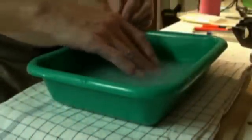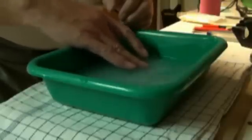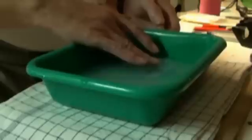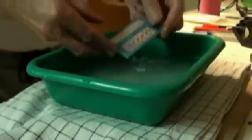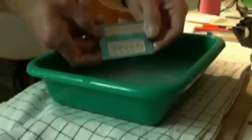The development takes place in a 10 gram per liter soda solution where you move the silver around and carefully make sure that it is stirred thoroughly. The bath should preferably be 25 to 28 degrees centigrade. When ready, it is washed off and dried very carefully. It is then protected and mounted so it can go into a 5% nitric solution on the plus pole.